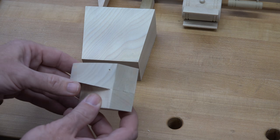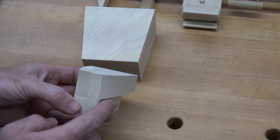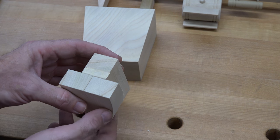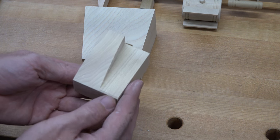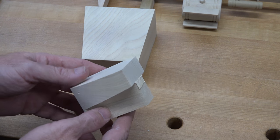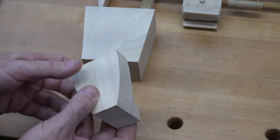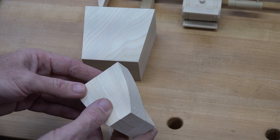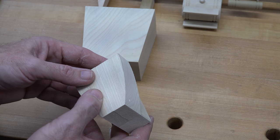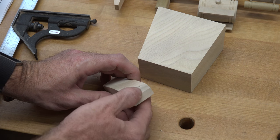Just like that, we have both profiles done — I put them both on the scrap block at the same time to give me more clearance from the edge of the sander and more room to work with my fingers. If it feels good, do it. Now we break these away from the scrap block and work on the chamfer on the front. That chamfer is nothing more than marking it and hand sanding or using the belt sander — whatever you prefer.